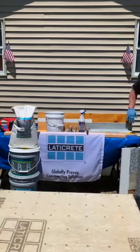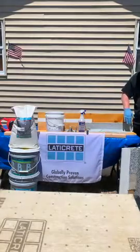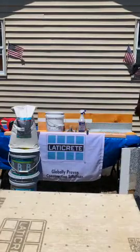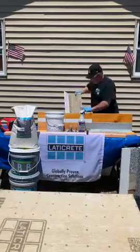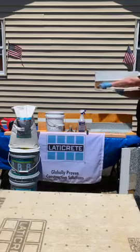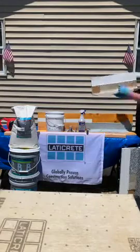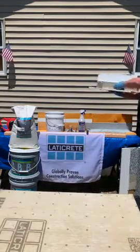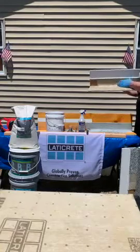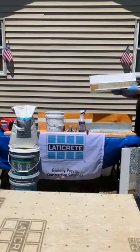Once the cove is finished, we're going to come back here after it cures and put a grout coat in there. The grout coat is basically going to fill it in and lock it in nice and smooth so your resinous floor will go right on top. Now, in doing the steps, this is the tack coat. This piece to here is the actual cove going up. This piece from here to here is slicker. You may be able to see it. This is the actual grout coat, and then you go on top of it with your resinous floor to match your floor.